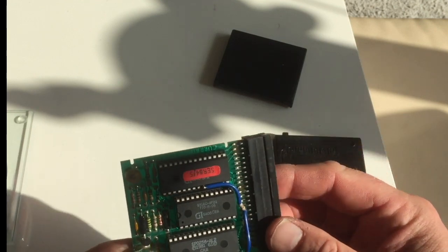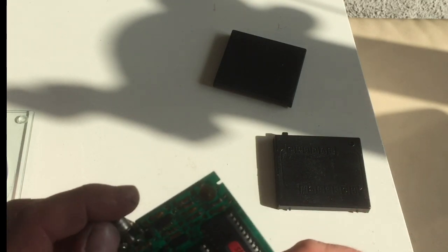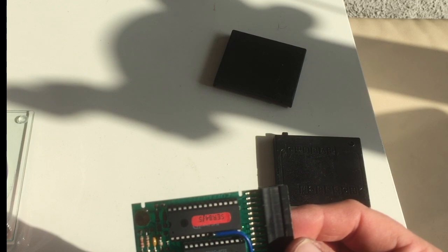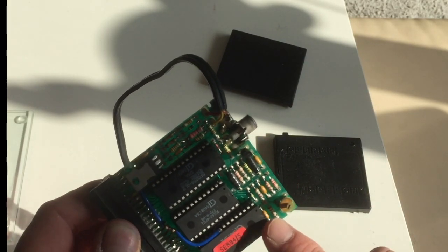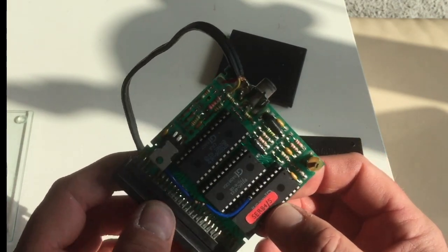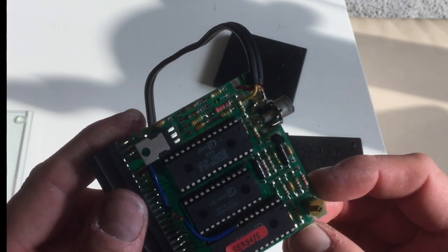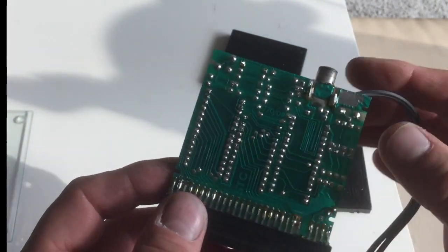As you can see from the chipset that is on this little PCB, it's difficult to say when this particular unit was made, to be honest, but the General Instruments 8407 is 1981, and the 8408 is not really sure. Other than that, we have a ROM chip of some description with a serial number on it. It says 84-5, so I'm prepared to say it's mid-1984. It says Currah 770-08 copyright, so perhaps it's speech unit 770, not really sure.